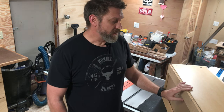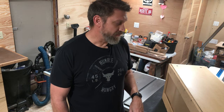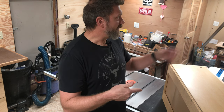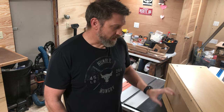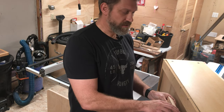So like I said, these are free cabinets, cheaply made out of fiberboard. I'm not even really sure how they were attached — it looks like they were probably just screwed through the fiberboard from the back panel into the studs of the wall. But I've got this space to make up for above the drywall, so I want to beef this up a little bit with some 5/8 inch plywood. I'm just going to attach a strip here with glue and pocket holes, and then I'll have something nice and solid to attach these French cleats to.